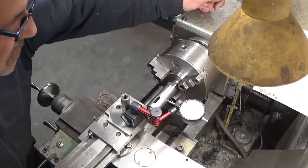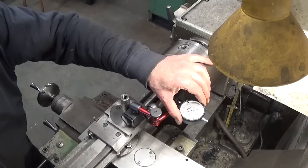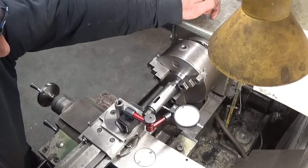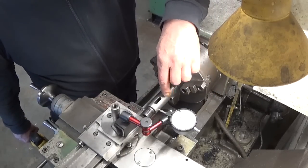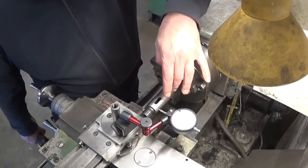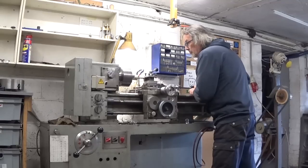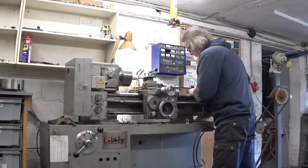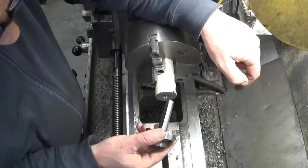It's not exactly the same. So for the inner taper this setting is okay, but to make the outer taper I'll have to make some changes. I stopped cutting a little bit early because I wanted to do a test fit - I gave it a little line with my Sharpie.